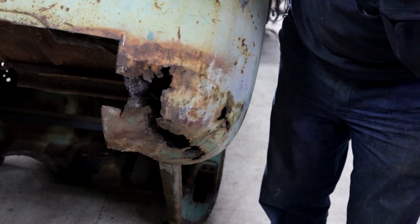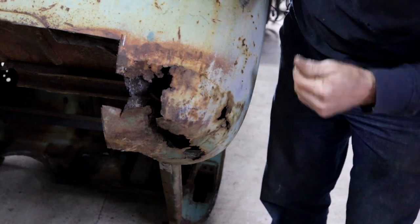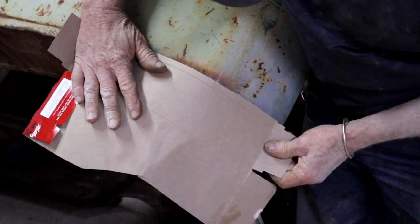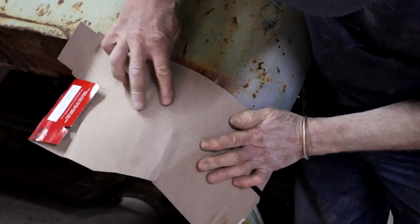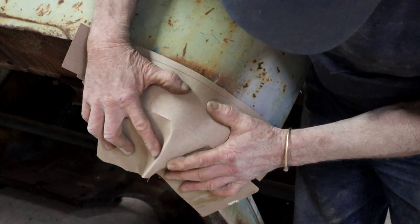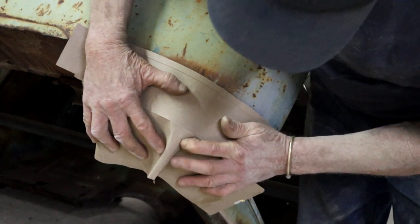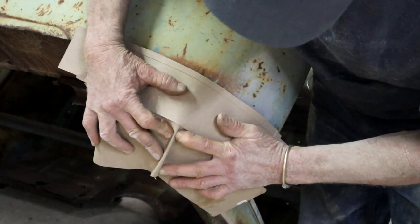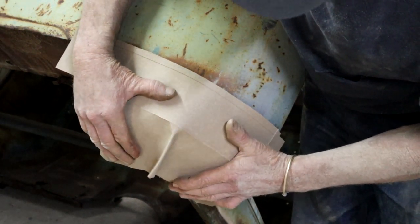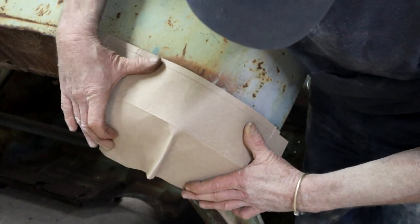So what am I going to do here? Problem is I don't have an English wheel to do this compound curvature, I don't have a sandbag. So if I take my cornflakes box and put it on here - you can see that way, that's great. But here comes the problem: if I go in, there's the compound scenario. A lot of shrinking would need to happen here, and stretching there. So I'm just thinking - maybe I should just give it a seam there, like a cut there. Because yes, it's a lot of shrinking and stretching and I don't really have the right tools - or the skills for that matter. Never done it before.